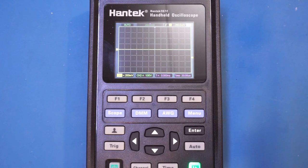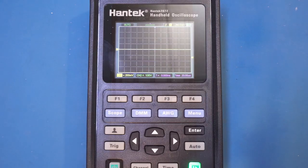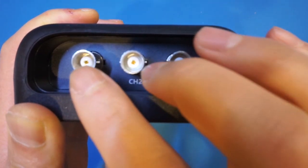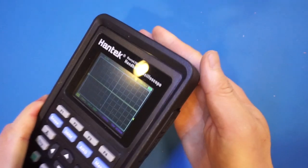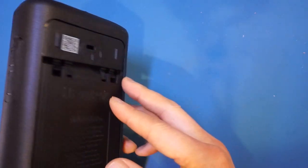It is a rather basic dual-channel oscilloscope, but it does have most of the functionality you would expect in a typical DSO. It does not have protocol decoding, although if Hantek really wanted to, they could probably implement that feature inside the FPGA. I did not see any mention of the input impedance, so I assume that is probably one megaohm only. The BNC jacks are flush with the top of the unit, which is a really nice design so you don't accidentally bump into them.